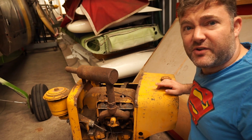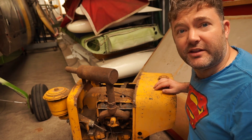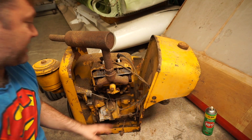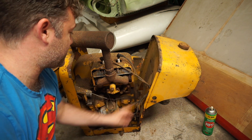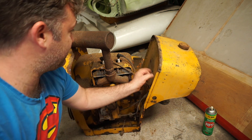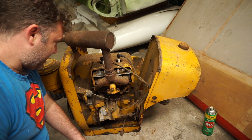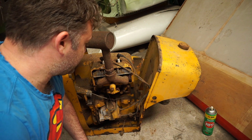I'm also going to go around later on and take some better shots of the actual machine because I'm aware that my camera work in the last video was a little bit on the shaky side. So to get this tank off I'm going to have to actually undo this little bracket here because the spark cables are tied to the cowling wall just to get them out of the way. I'll need that to go so that I can get to the bolts underneath.